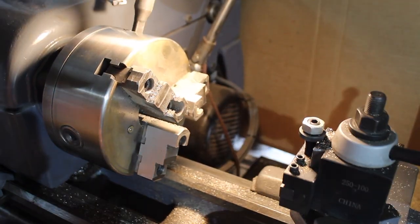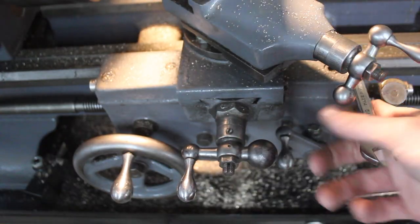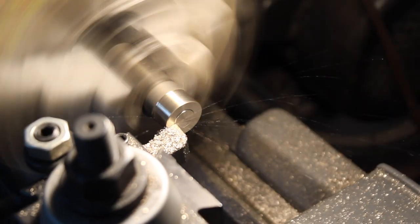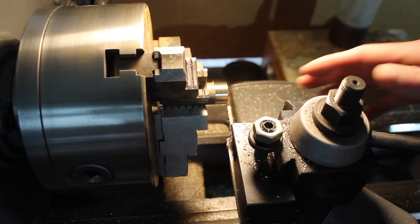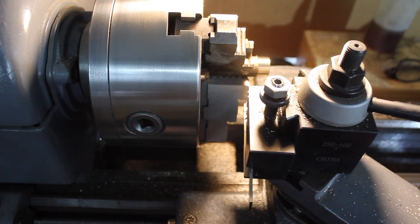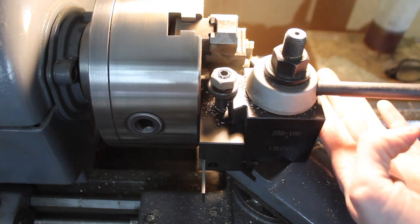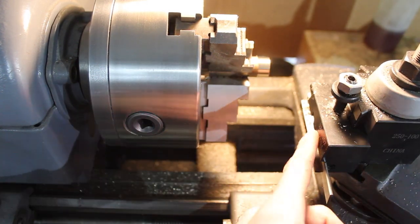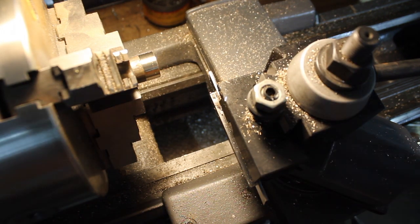With the cannon done I wanted to machine a couple little wheels for the stand. I used the same piece of bronze — nothing fancy — I pretty much left it at the same diameter, just trued up the edge so it was nice and shiny, then faced it off for a flat surface, drilled a hole, and parted them all off. When using a parting tool it really wants to be exactly 90 degrees to the part. What I like to do is retract the parting tool, bring it right over to the face of the chuck, slide it right up against that — that's going to be perfectly square because the face of the chuck is perfectly square — hold the cross slide tight against there and tighten it down. That sets it up perfectly 90 degrees and it takes about five seconds.